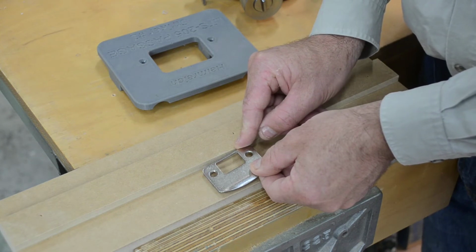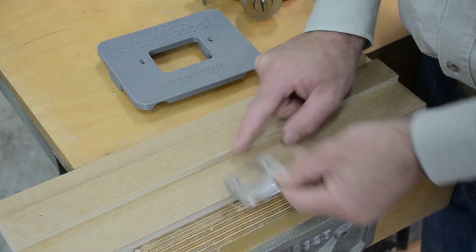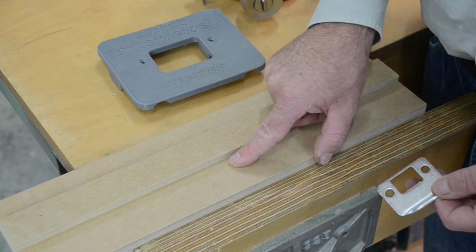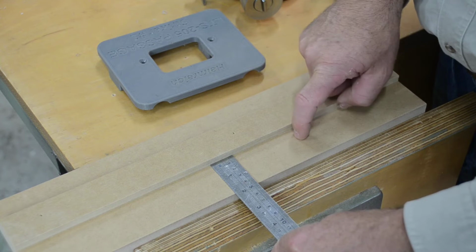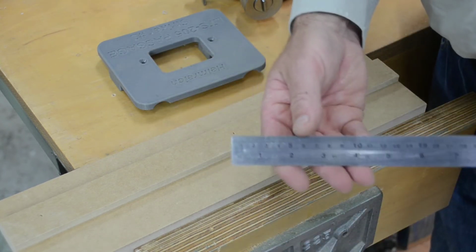Very rarely will the door be that thin, and you certainly don't necessarily have to place it hard against the doorstop. So this rebate for the door would be pretty much proportional to your door thickness. This rebate could take something like a 45mm door, which is about 1 3/4 in the old currency. Very handy, this rule's got both.